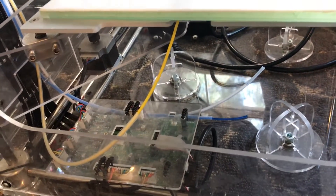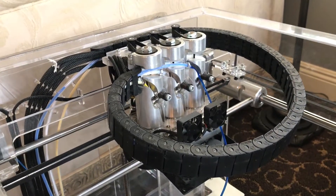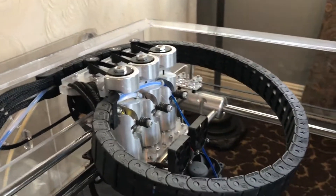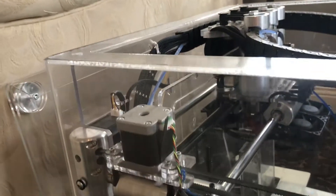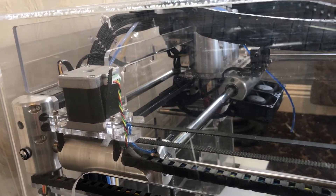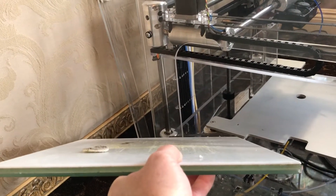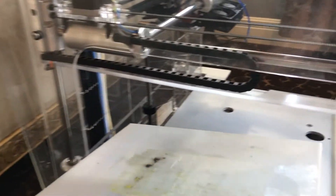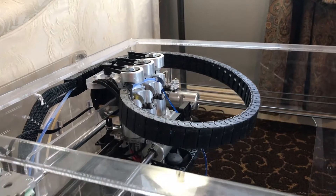I changed it out to a higher wattage power supply, and for the hot end I went to an E3D Titan Aero extruder — I have that on my reworked Prusa and I'm very happy with it. I reused much of the wiring and the motors, and I designed parts in Inventor and 3D printed them for the X and Y axes. The original build platform was also like a lethal weapon — a couple of pounds of sandwich glass material — so I got rid of that too. I have it functional now and will get the parts up on Thingiverse once I make some minor tweaks.